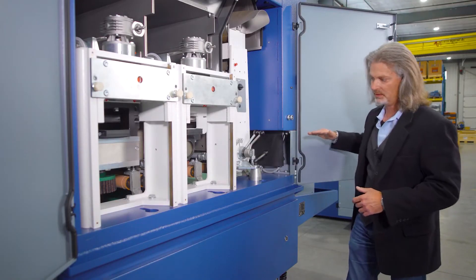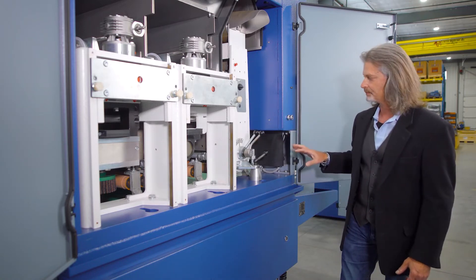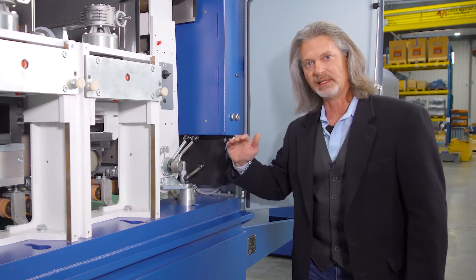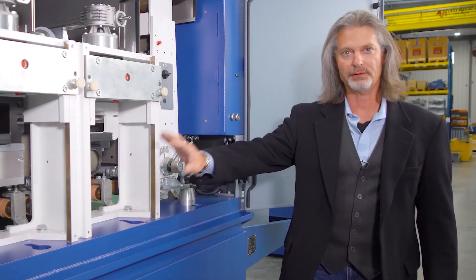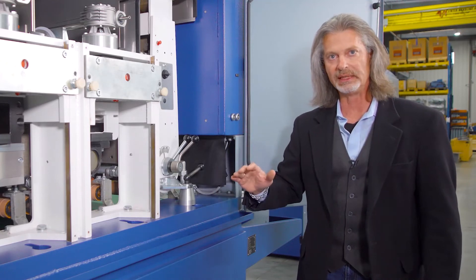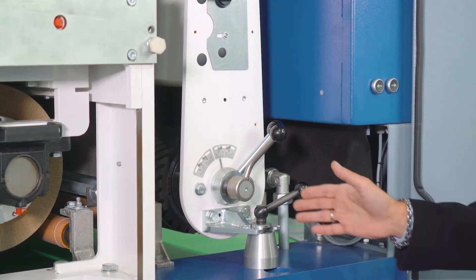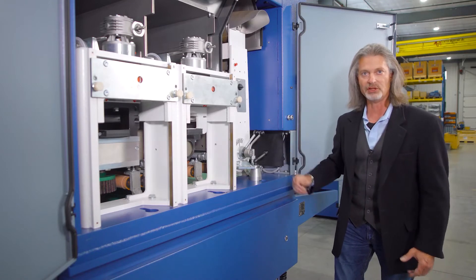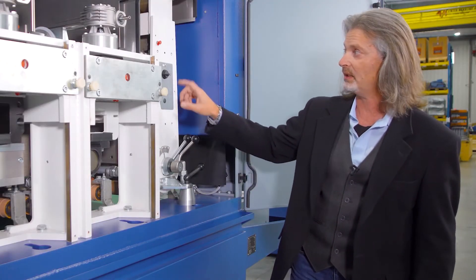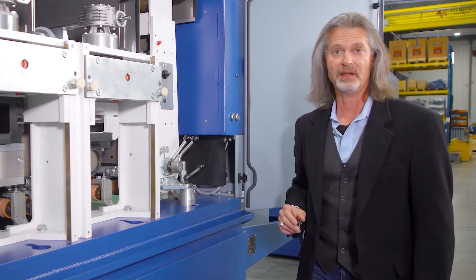This would be front to back — this is the in-feed side of the machine. On the abrasive belt head, we are removing a vertical burr. Whatever vertical burr is left over is laid lateral or flat, which makes it easier for the brushes to not only finish removing the burr, but to round or deburr the edges completely. This particular machine has a variable speed contact drum, so you can run the abrasive belt at different speeds to accommodate whatever application you have — your material size, thickness, and burr height. It's also adjustable to accommodate different thicknesses of abrasive belts, anywhere from a very thick Scotch-Brite belt to a very thin micro-finishing belt.